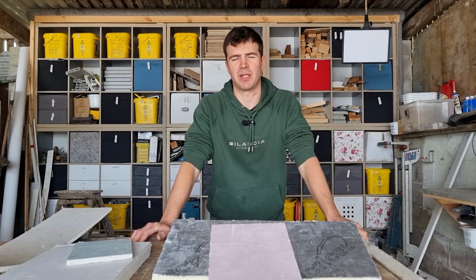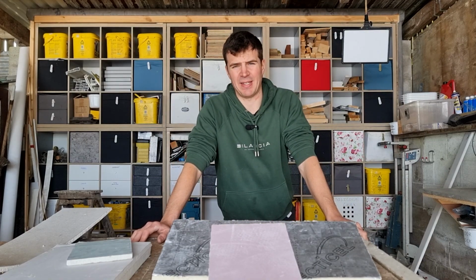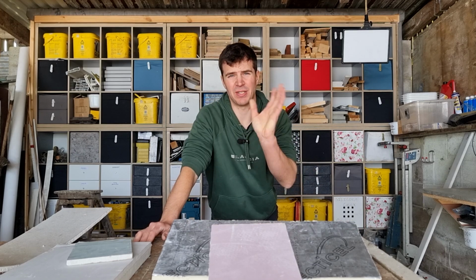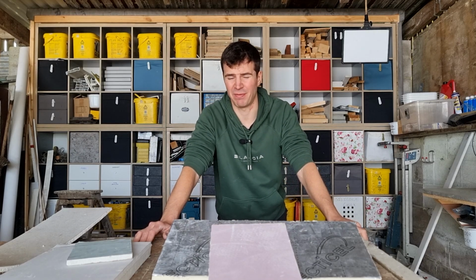In this video, I'm going to explain how you'd prevent plasterboard from cracking. The biggest reason why plasterboard cracks is because there's some movement behind the plasterboard. Plasterboard itself is a very stable material and it will only start to crack if there's some kind of movement. Now that movement can be caused by lots of different things.